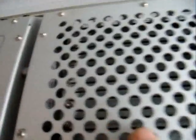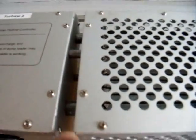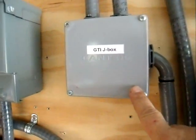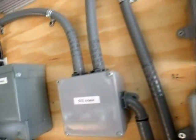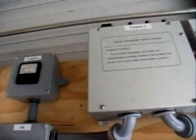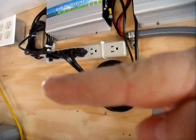What I'll do this week is take the resistors — the resistive load, those heating elements you can see inside — and disconnect those from the terminals. I'm going to wire those through here right into my junction boxes, which come down this way to this box and then go up into here. I'll wire it so that when the system gets to the appropriate voltage, they'll discharge out by doing a dump load, and instead of dumping to resistors, they'll just dump here.